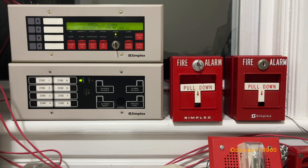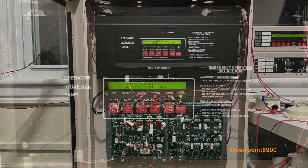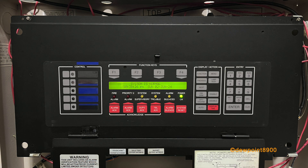And that concludes this demonstration of the 4020. Now let's take a look inside the 4020 panel. The 4020 uses the same cabinets as the 4002 and is available in three sizes. This one is the mid-size or four-unit enclosure. The top bay contains the CPU, power supply, and main motherboard. The operator interface of the 4020 is identical to the 4100+. Panels made from 1994 onward include the priority 2 alarm indicator.